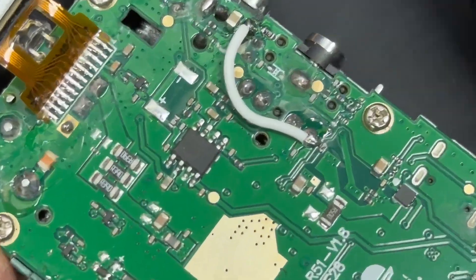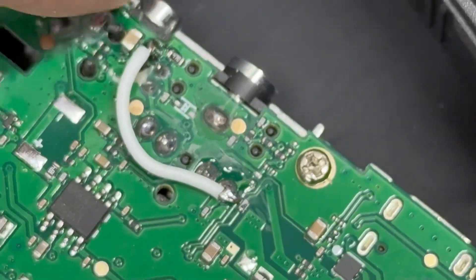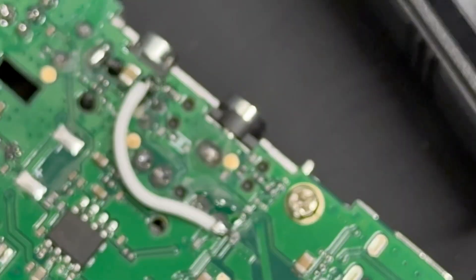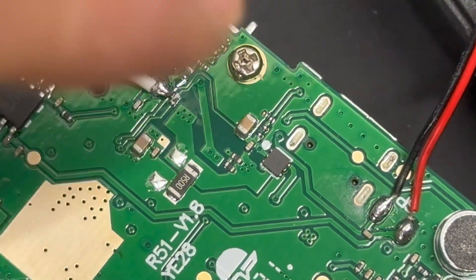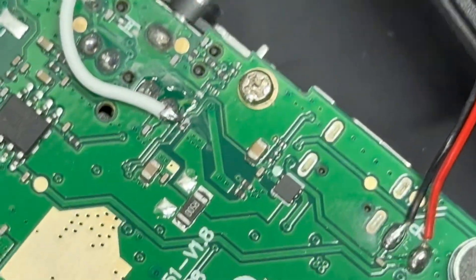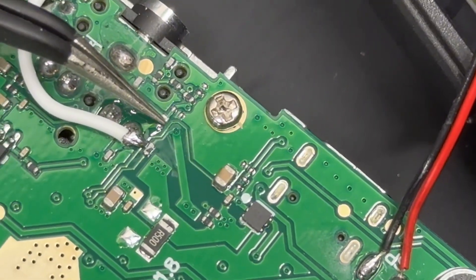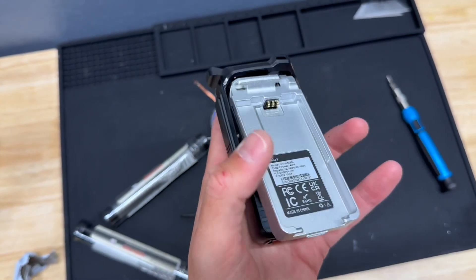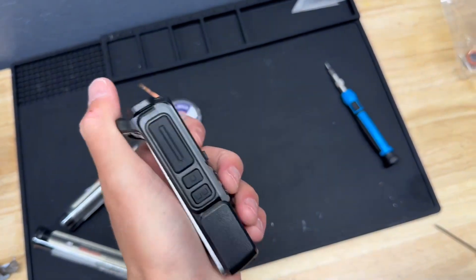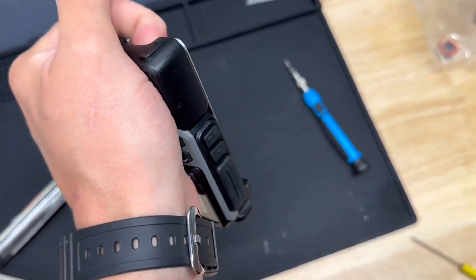Here you can see it completed. Use the bottom blob of solder — attach it to that blob of solder just beneath the audio jack. You'll also notice that resistor, if you look closely, it's gone. There was a resistor in that location right there — I'll indicate it with these little pliers. Remember to slide that little plastic piece back on right there; just insert and snap it in. You might need to give it some force to snap it in fully. That was the NR7Y mod as found on the Soda Plus YouTube channel.